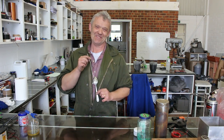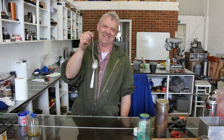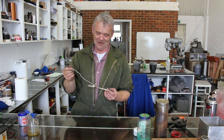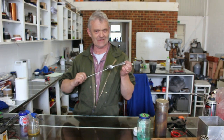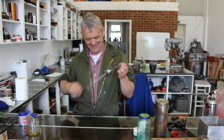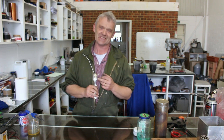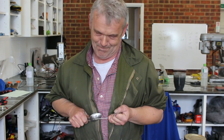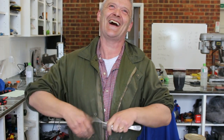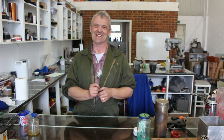So there it is, all finished. We have soldered a wire onto a spoon. I cannot think of any use for that whatsoever, but soldering onto stainless steel is told to be next to impossible, and there it is, soldered on. I'll just give it a little tug — that's pretty strong, actually. So that's a fairly good adhesion, and that's courtesy of the copper plate underneath. It tells us that the copper is adhering to the stainless steel pretty tightly, and so we've been able to solder onto it. I'm going to try and break this joint. Well, bloody hell. Anyway, I hope that was of interest to you, and thank you very much for watching.